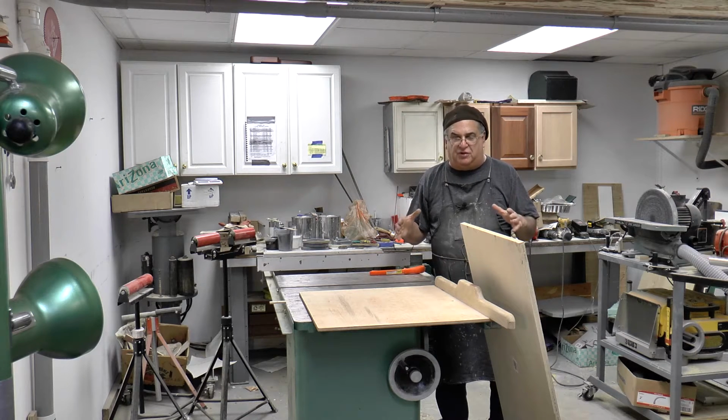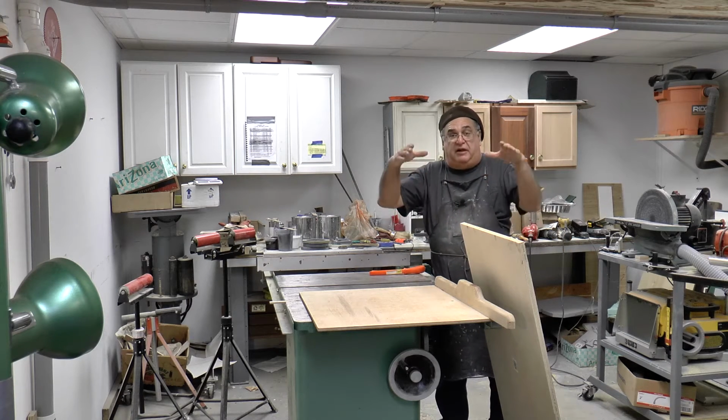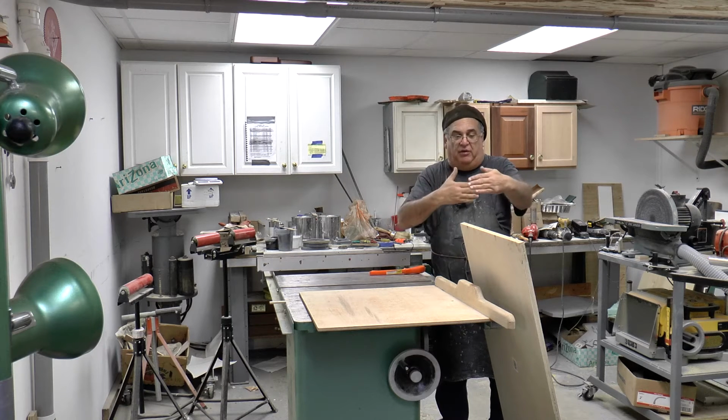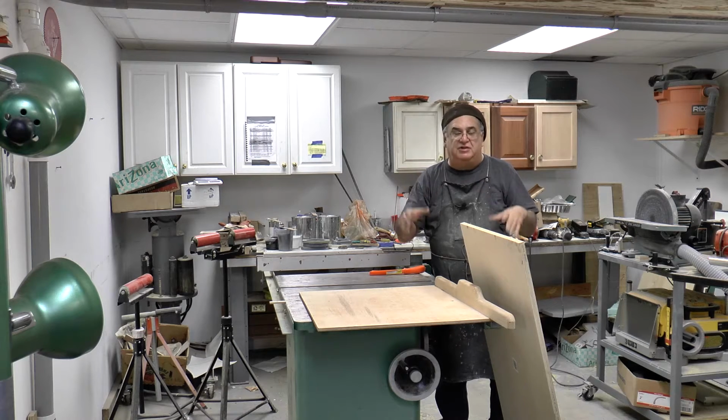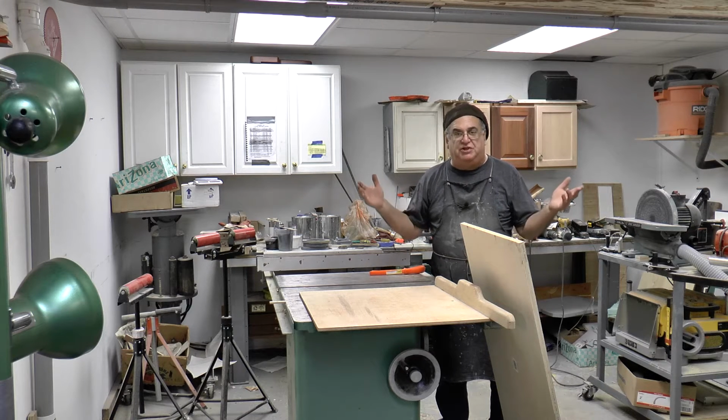And then you have what's called a molding board underneath, a heavy board with two other boards on the bottom. And that's what you can pick it up with, because that's how you move the mold to the floor. But you have to put a jacket on that. It's a metal aluminum thing that goes right over the joint. It comes down and holds them together. So you have to have a bunch of jackets. Six of one, half a dozen of the other. You got a bunch of steel flasks around or a bunch of jackets.